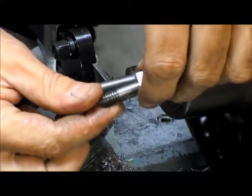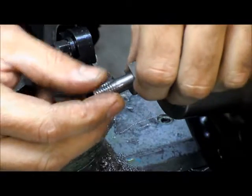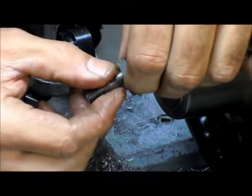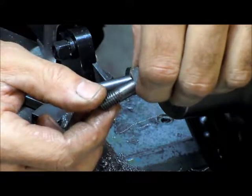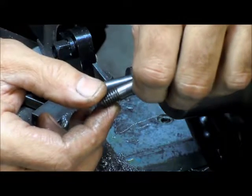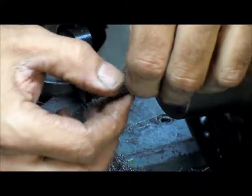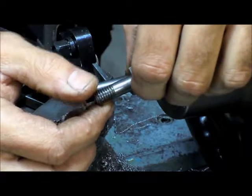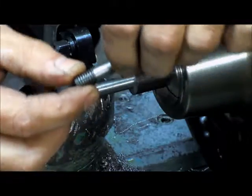The shank on these ones is at .375, and in the T-slots in the table, sometimes there are some tight spots. And I don't think there's any real reason for them to be to size. They're not really locating, the vise is located with a keyway, so I'm just going to relieve that about, I think, somewhere around 20 thou, just so they're nice and easy to get in and out of the T-slot.